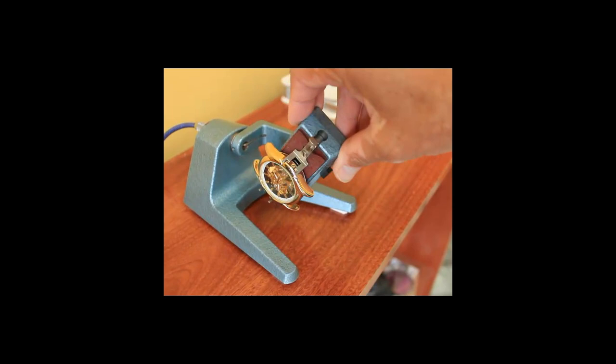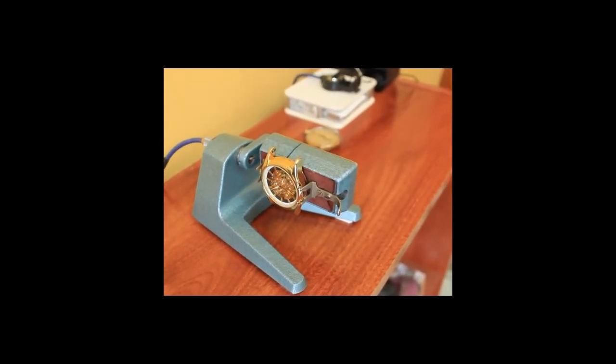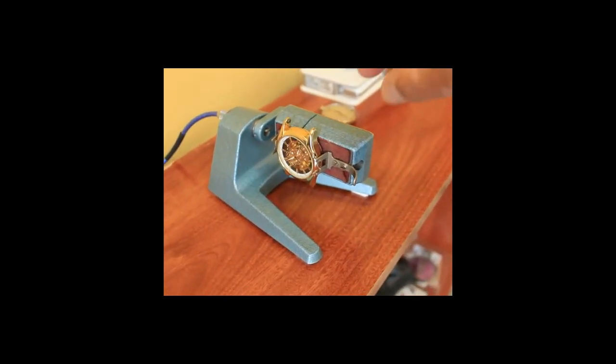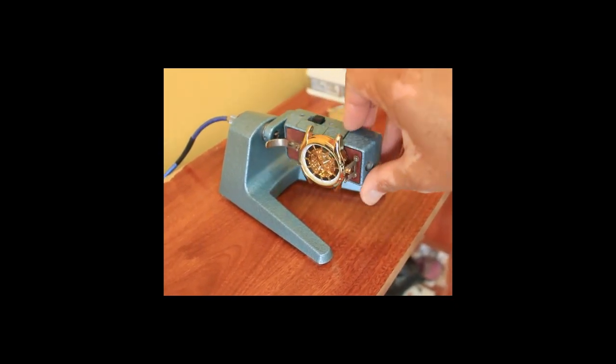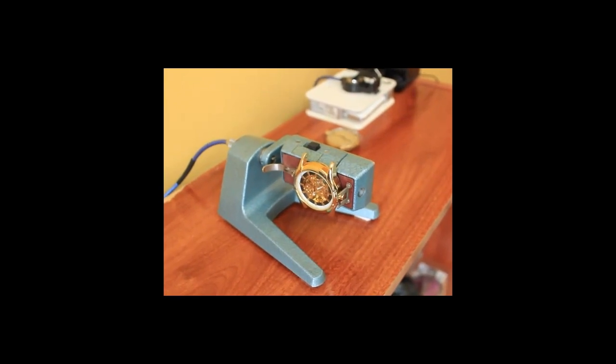For example, be sure that the watch mechanism is clean, properly oiled, greased, tuned, and efficiently corrected for the beat error. Then, with the help of the watchoscope, the regulation protocol is realized in several positions. The watchmaker will have to intuit the habits of the owner of the watch, or ask for them.